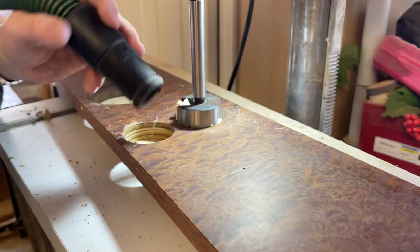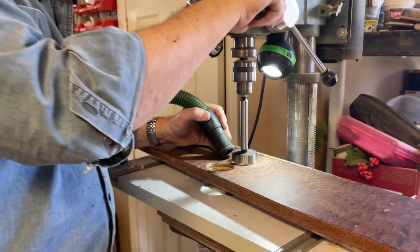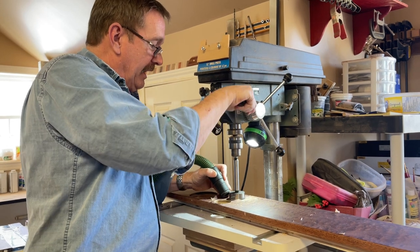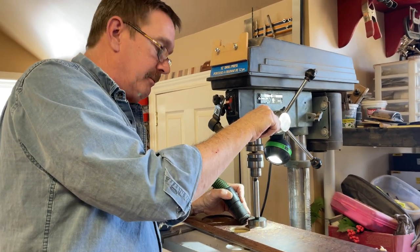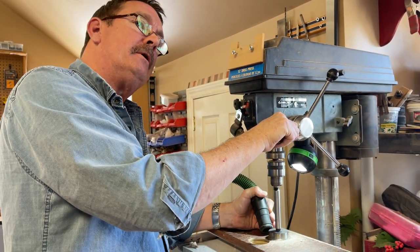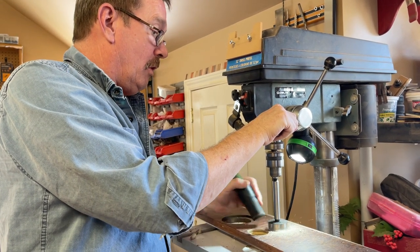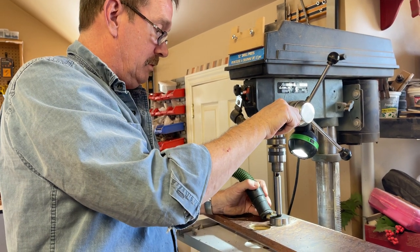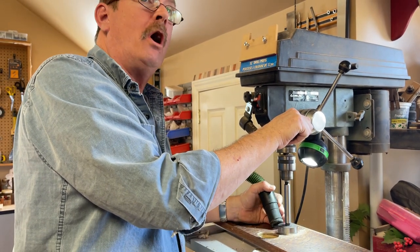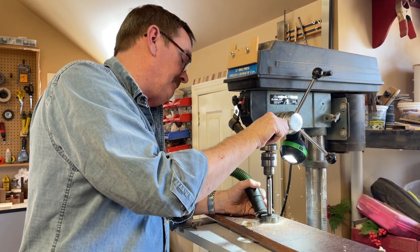You notice I sanded it all down before we got started, as opposed to the last time. There were some people asking why we bother to even put any finish on it. But putting the finish on sort of stabilizes the veneer. I would think you would put it on this way. It's easier to sand it with no holes in it. Some guys will do all the holes and then put the veneer on. I wouldn't do it that way.